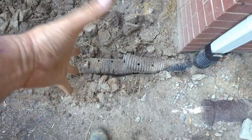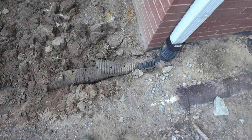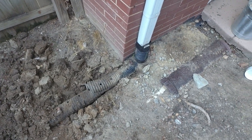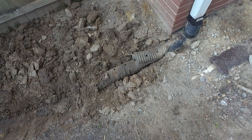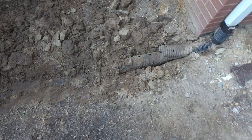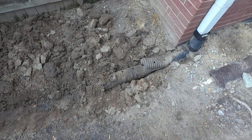What this type of pipe does is it takes the tremendous amount of water coming off the roof and puts it underground where it's got nowhere to go because it's not daylighting out anywhere — it's just seeping out of the pipe. You never ever want to use perforated pipe after you've caught water in a downspout. A perforated pipe is used to collect water, not to disperse water, especially underground near the foundation.